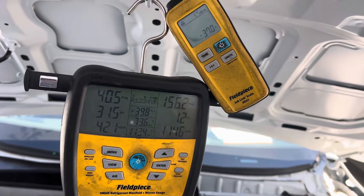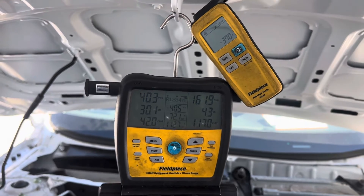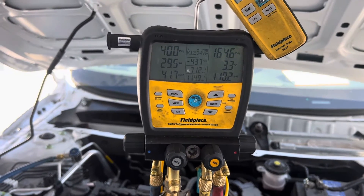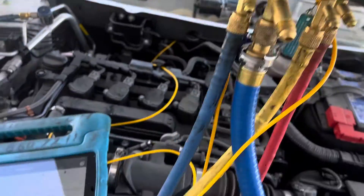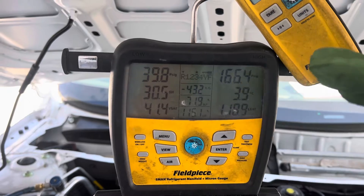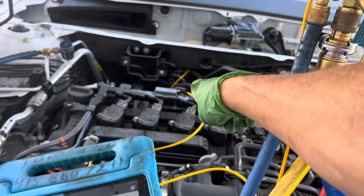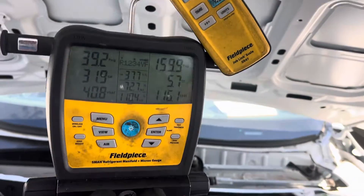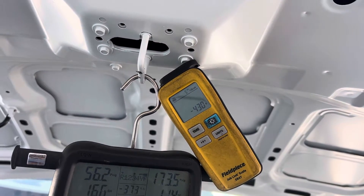It doesn't matter if you spend $1,500 on an Apple phone — they're mediocre. The only reason I went from Android to Apple is because a lot of my software for engineering and interfacing with apps wouldn't work anymore. Android has some glitches and Apple seems more stable on some things. So what have we done here? We have gone down to 30 subcooling. Superheat is going back and forth between 3 and 5. We're almost to factory — 445 grams is what we want, so I'm going to stop somewhere around 440.